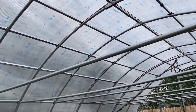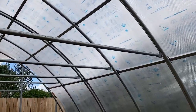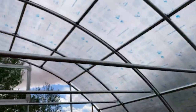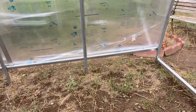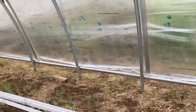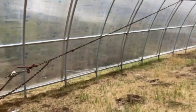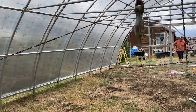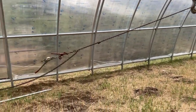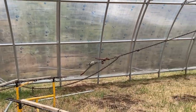My son Bridger is at football practice this morning and will come in to finish the screwing. As for that gap at the base — you're going to be backfilling with at least four inches of compost in here. You could buy extra polycarbonate and do a lap joint, but there's no value in putting polycarbonate at the base since it doesn't get any sun. The cleanest, smartest, and cheapest solution is to just fill up that gap with dirt when you're backfilling — it seals up well with no issues.